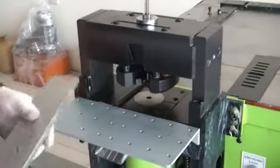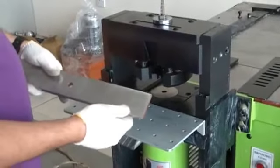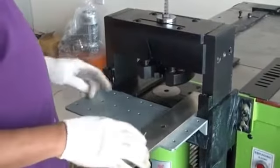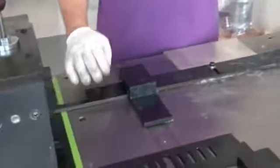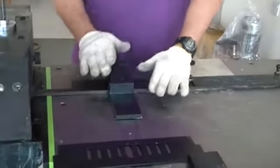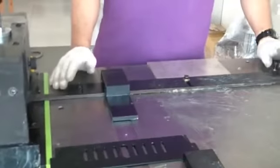So I have this kind of busbar that is 10 by 60. So I'll show you how to punch without marking. So in this machine there is also some operation you can use without marking. We have a jig guiding busbar here behind. This is the one plate you can adjust according to your requirement. And we have also a stopper here. This stopper you can use for punching from the packing section. So in this jig, you just adjust according to your requirements.